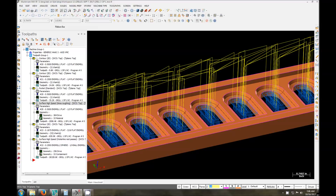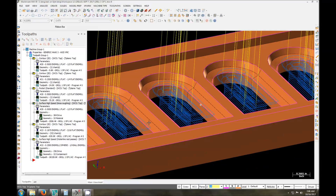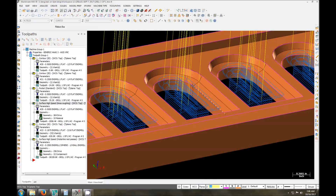Next I'm going to be roughing out these pockets using high-speed area roughing. I really like this one — I like it kind of better than offset if I'm trying to do something relatively quickly. You can see it's going to step down in 50-thou step-downs. That's just going to make sure it has some nice little cusps there for it to mill — not leaving too much, not taking too much away.